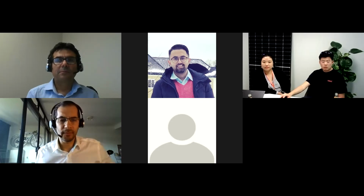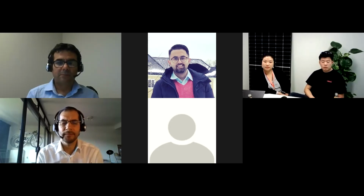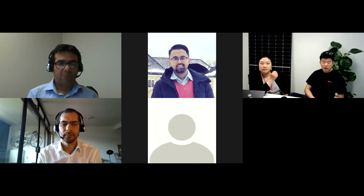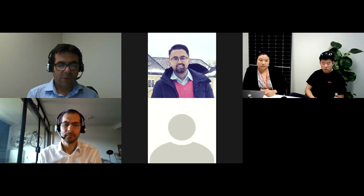So I think you put the answer there, but I don't know whether you want to expand on that at all. Right. Yeah, so basically, for example, if you want to design a bifacial system, what people normally do is put everything into software like PVsyst. And we've done some simulation for some of our commercial customers, for example. On a tin roof, what they normally get is around 2 to 3% gain from the backside.